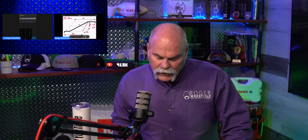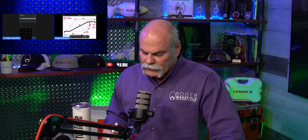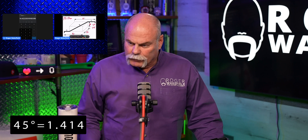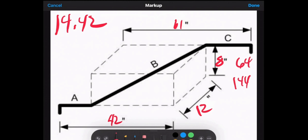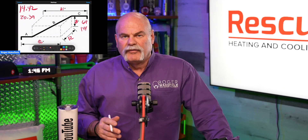14.42 is going to be our true offset. We know that if we measured that offset center to center it would be 14.42 inches, but we don't have that directly — that's what we use this formula for. Once we have our 14.42 we multiply by our constant. The standard multiplier for a 45 degree offset is 1.414, so 14.42 times 1.414 equals 20.39 inches. That tells us that piece B is going to be 20.39 inches, and we got that from the 45 degree multiplier of 1.414.